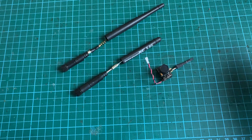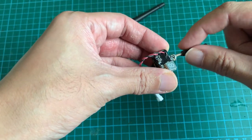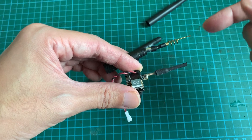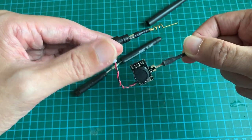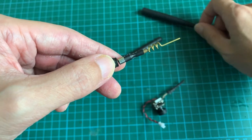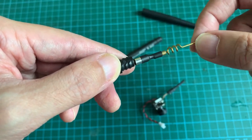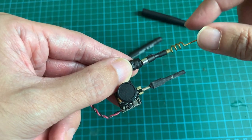So what good is this antenna for? If you're flying analog and using one of these micro VTX units, you could replace the stock antenna with this one — just cut the cable and solder it to the VTX for higher gain. The radiation pattern is a flattened donut rather than a full donut, so if you're doing a lot of acrobatic moves it may not be ideal. Also, be sure to heat shrink the antenna — without the plastic conduit on the outside, the center frequency shifts upwards. Adding heat shrink will shift the center frequency back down to 5.8 GHz.